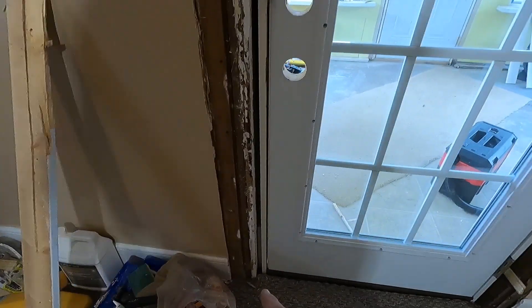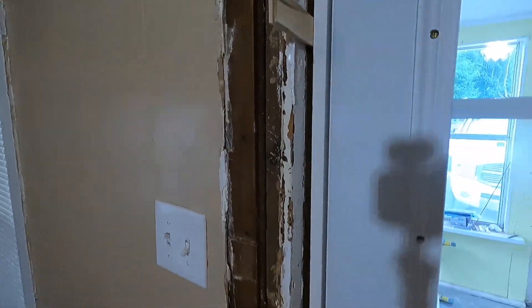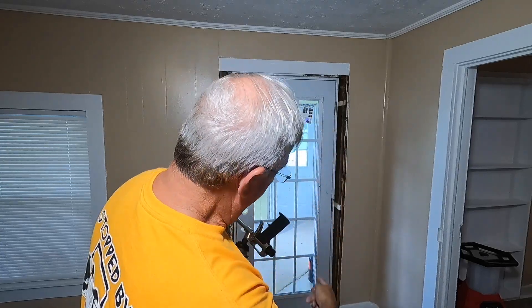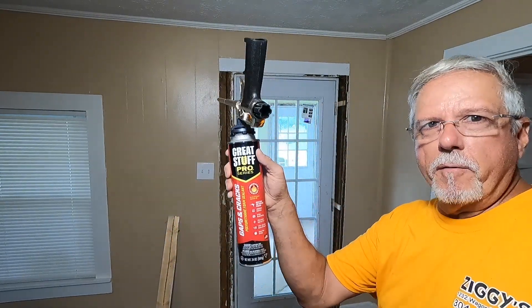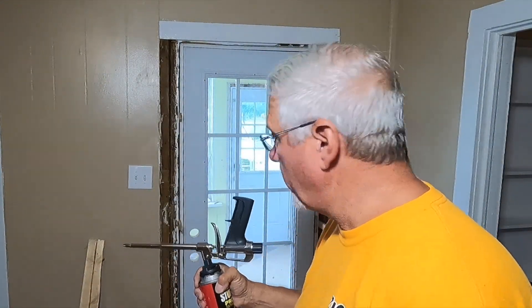I wanted to show you that I put a little four-by block down there, put some wedges here, and I've got screws in those wedges. What I really wanted to show you - I had a guy comment one time on one of my videos, I think on Facebook or Instagram, and I was putting trim up, wedging a bunch of stuff in, trying to take up space so when you screw it in it didn't spread out. He was saying he used this foam to fill all that in - it insulates and gives it rigidity, pushes out against it and holds it good. We're going to try that on this door; I've never done that before.